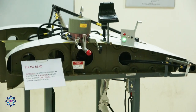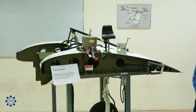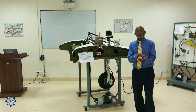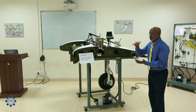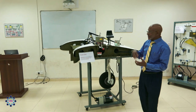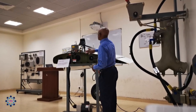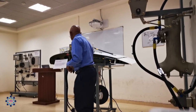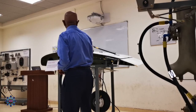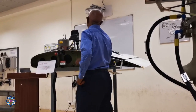Here is your master switch. At this panel we see a green light. This green light means the landing gear is down and locked. This landing gear has a mechanical lock. The landing gear will be pushed by the actuator — the actuator is pushed by the piston — so it pushes it down to the end, meaning the actuator is always down, the landing gear is in the right perpendicular position, and the mechanical lock is on.